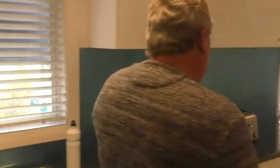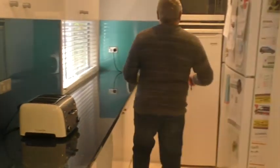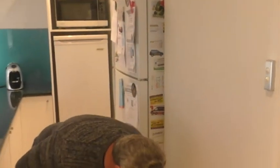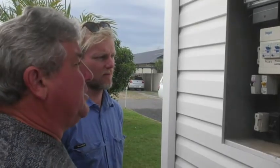We'll turn off and unplug everything in the house — unplug the toaster, unplug the microwave, unplug the fridge. We've unplugged everything and hopefully it will reset — which it does. So we know there's another appliance that's no good and it needs to be found. We re-plug everything back in one at a time until the switch trips again. When it trips, we know exactly which appliance caused the problem.